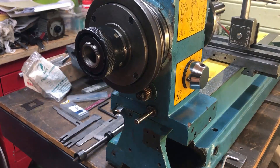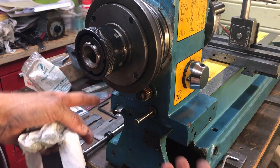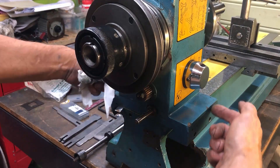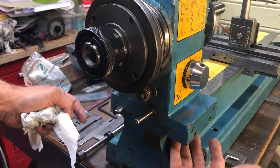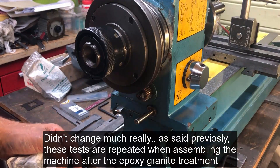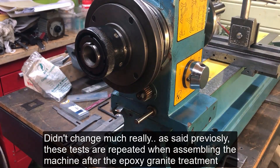I will do one more test before I really scrape it, because I've only snugged these bolts. I will also tighten from the underside the headstock mounting bolts to see if that changes the situation — that will be the best result rather than scraping depending on a loosely mounted headstock.